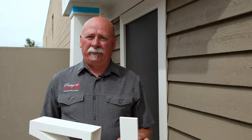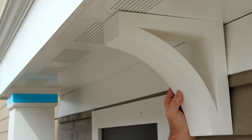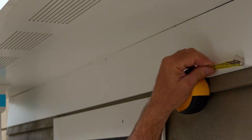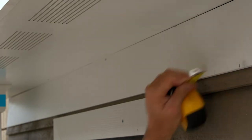For the next step we've got to create a ledger. A piece of 2x4 or scrap PVC can be used to create an installation plate. Find your desired area that you'd like to install your bracket and simply mark the side. Now we're going to measure — the wall thickness is a half an inch — we're going to measure in by one half of an inch, which is the wall thickness of this particular bracket.